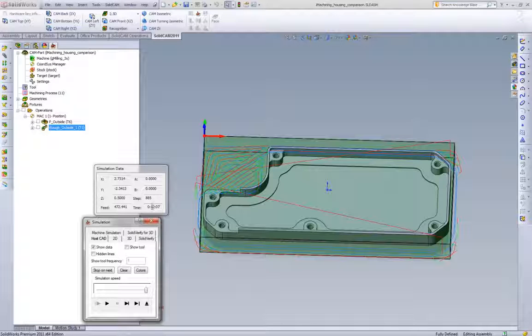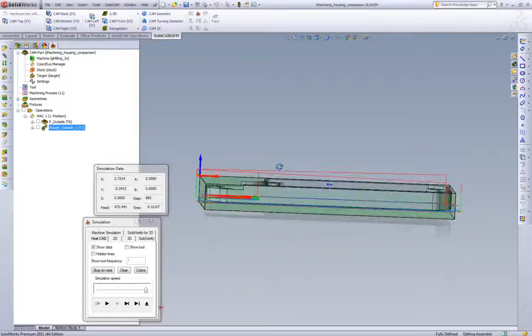We see the iMachining toolpath is 12 minutes and 7 seconds, roughly 1.5 minutes quicker than even the standard pocketing or offset strategy with the same step over, feed, and speed. Now, how does iMachining do this? It does this by a couple of things.